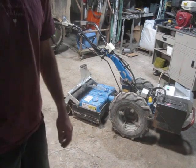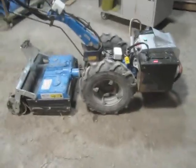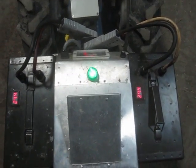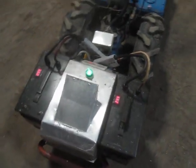The batteries are wired in parallel rather than in series, and each of them has a little voltage display. That one's showing 24.4 and not surprisingly that one's at 24.4 also. They actually balance out if I leave them plugged in, because whichever one is high gives up a little bit of charge to the other and they equalize — though they don't necessarily equalize on a cell-by-cell basis.